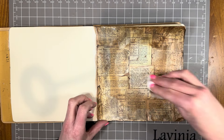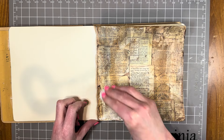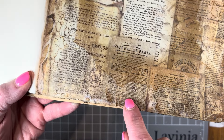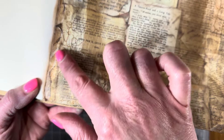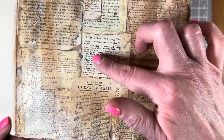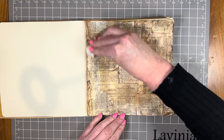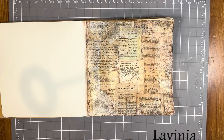I'm wiping as much back as I want. In some places where the crackle paste was a little bit thicker, that's made quite a difference to the cracks. Can you see how the paste has gone into the cracks and now it shows up? Where it was thinner, the cracks are so fine — really tiny little cracks — and then larger in the areas where the paste was slightly thicker. That's given us that really aged look, and you can see the difference in color. With the baby wipe I've also moved a little color into the middle, bringing that aged look in without going super dark.